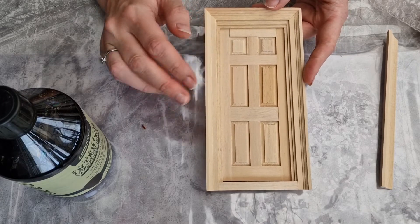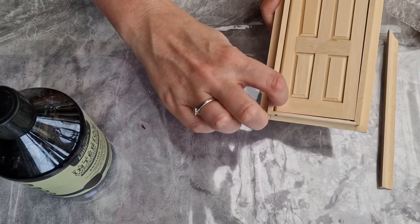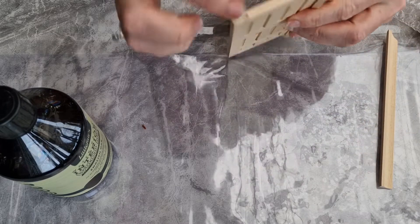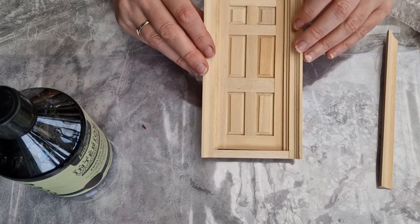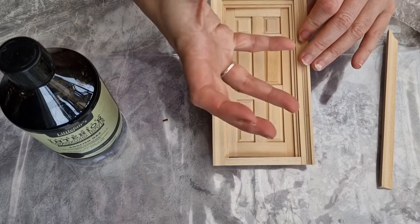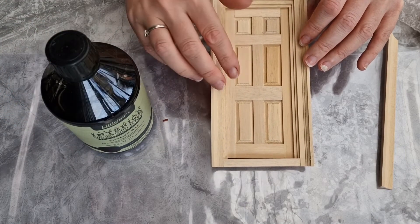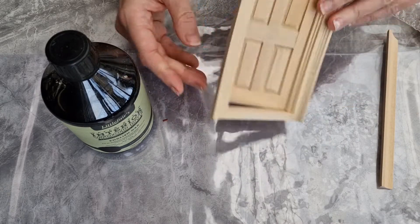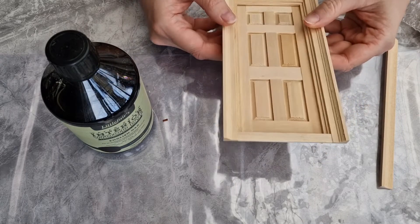You just need to make sure that you do a very light sand on the coats and then repaint, pretty much just dry brushing these molded areas and the edges so that it doesn't stick when it opens and closes. That's been very successful and I've never had any problems. Certainly with wood dye you won't have issues because it's soaking in — you're not adding any depth to the door, so generally with wood dyes you tend not to have any sticking issues. So I'm going to be doing this oak and this white.